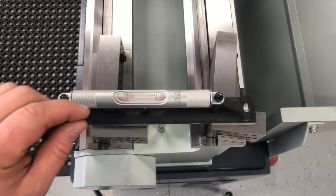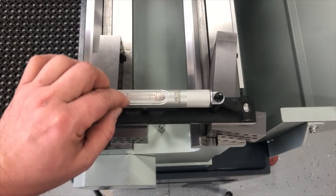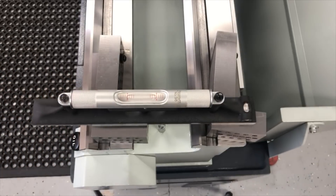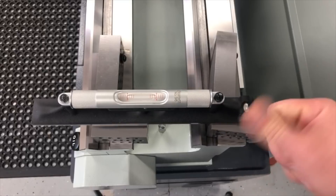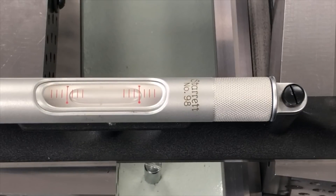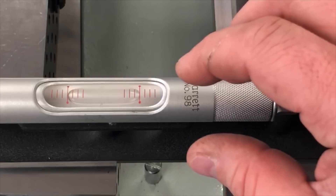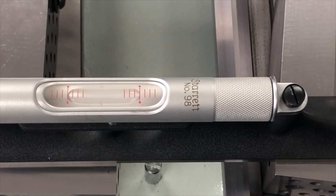Just to show you how sensitive this level is — we're almost in the middle here, maybe half a witness mark. I'm going to go down to this jack screw and turn it just a little bit so you can watch just how much it moves. I'm going to turn it an eighth of a turn and jack this side up — watch the bubble move towards the right. That's an eighth of a turn and it went past, so I'll back down off that a little bit, maybe a sixteenth of a turn. You also have to wait 10 to 15 seconds for this thing to settle — the bubble moves very, very slowly. That looks pretty perfect.